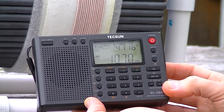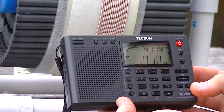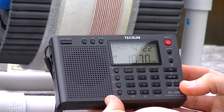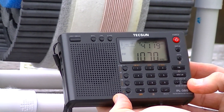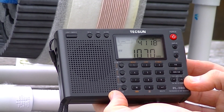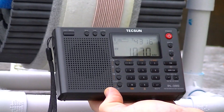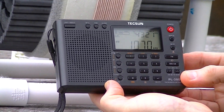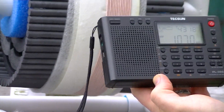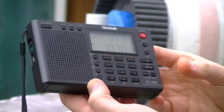I'm looking at the reading that I get on CFAX 1070. I have 41 on RSSI right now, and it was cycling around 22 on signal-to-noise. My inductive coupling of course changes as I move in and out, but I'm getting about 22. I'm going to be moving over to check my signal on the same station on the 4-foot PVC air core loop.